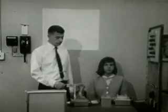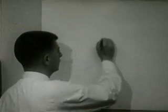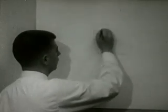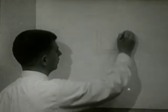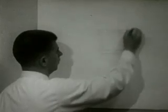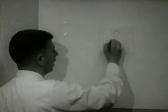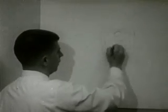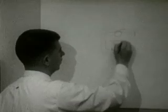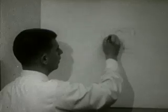The first device we'd like to demonstrate is this array of air jet tactile stimulators. To explain how one of these tactile stimulators works, consider a box filled with air, except for a small hole which is blocked by a ball bearing. Also consider an electromagnet which is enabled to pull the ball away from the hole, allowing air to escape.